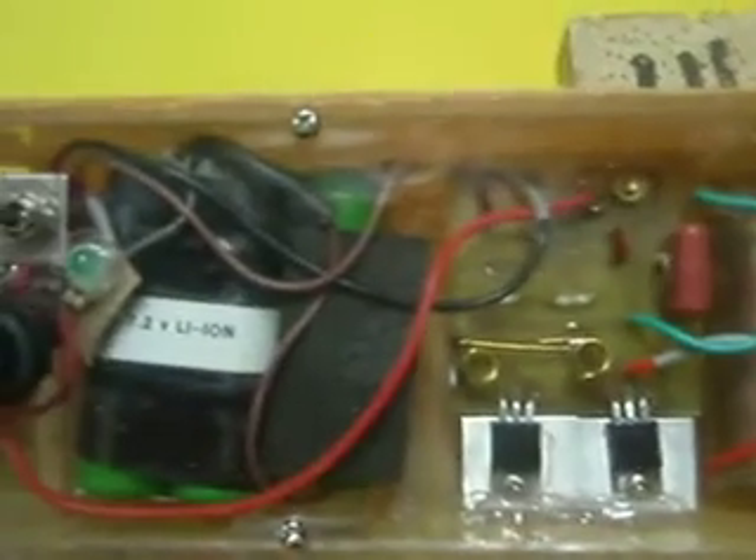Now that's what keeps this unit oscillating. The voltage generated depends on the battery used — in my case it's a battery at 7.2 volts, so on this first stage, on the output of the first transformer, I got about 350 up to 400 volts. Now this voltage is rectified by the full bridge diodes and filtered by the capacitors.